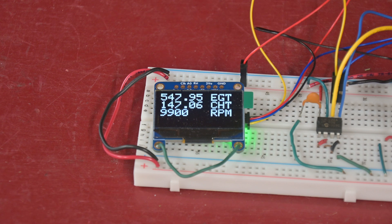I am not going to fully run it today — I just want to make sure this setup will actually work. Right now I am doing floating point math in the transmitter but I am going to be converting it over to integers, so you do not need to see that fraction of the temperature. Plus it also cuts EEPROM storage in half and data transfer over the radio in half too.